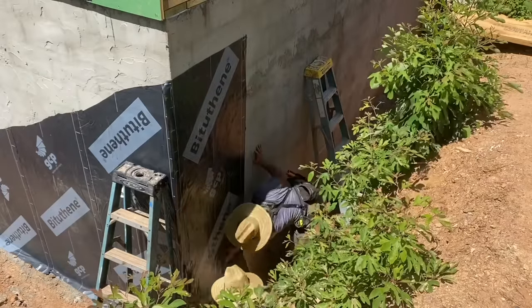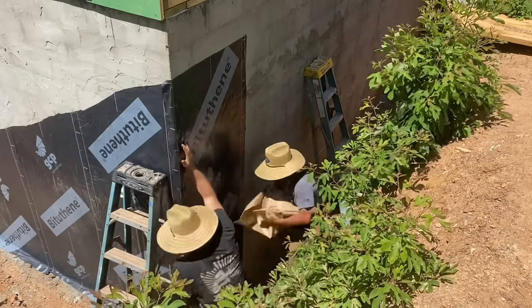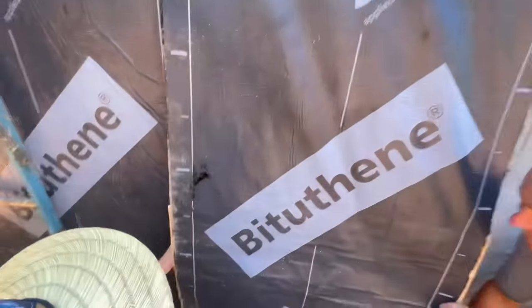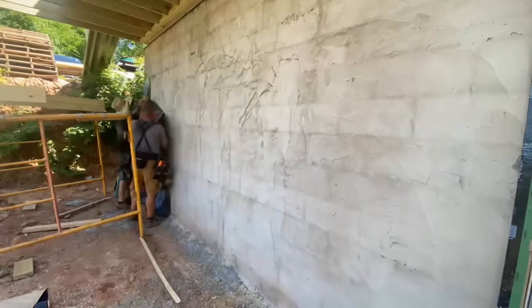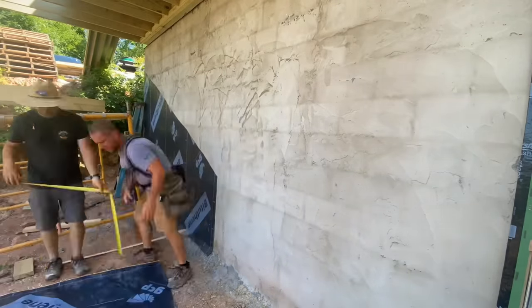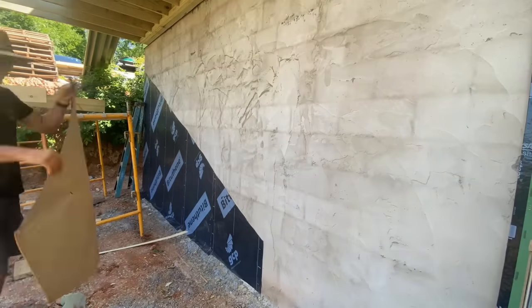The main advantage for us of using this type of membrane is that it works well, and also we can do it ourselves on our own schedule, which is really important when it comes to weather delays. This is just part of getting a good dry basement. The main thing would be making sure that the soil up against your basement runs away from the house, not towards it, and also that you have gutters over any areas with backfill, keeping water from ever getting in there to start with. I do consulting for a couple of local realtors here, and one of the main problems I've found with homes that have wet basements is missing gutters or clogged gutters causing a waterfall of water to go directly into the backfill. And if your French drain can't keep up, water is in your basement. This entire process took about two hours and cost about $600 in materials.